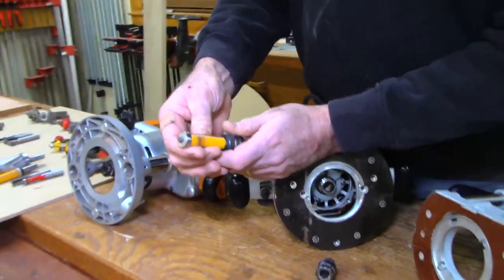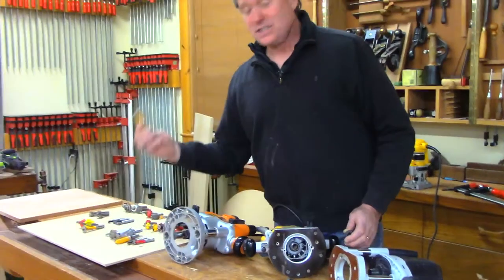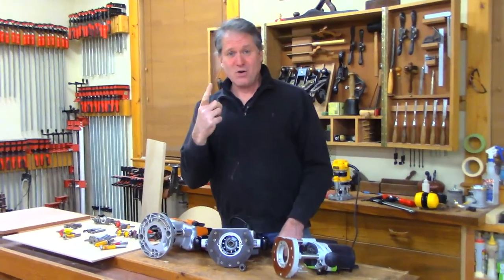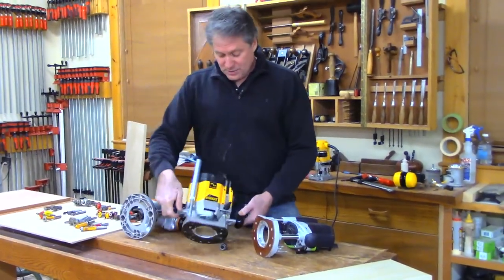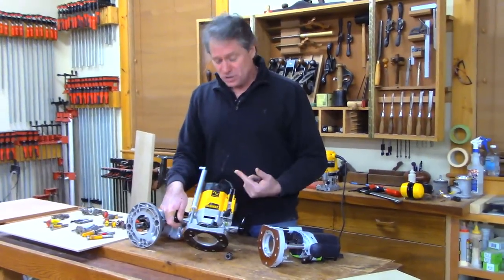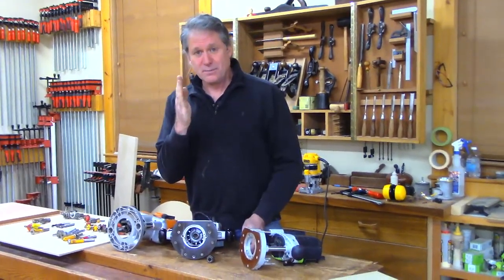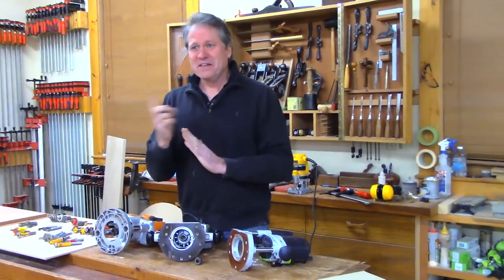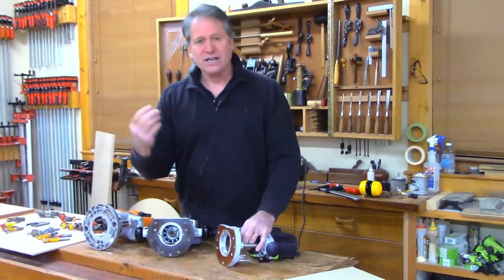Tell me about this, like, how secure is a spinning router bit? If you think of it like you get that gyro action, they're spinning. And on the DeWalt, you have an adjustment of speeds from 8,000 to 22,000 RPMs. So that's a lot of spinning, and that creates this kind of stability. It wants to stay in the center, but still, when you start working with it, if anything broke on that thing, I would feel better with a better collet system.